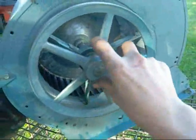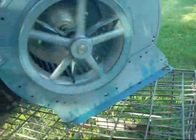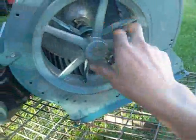I did save this Torrington blower though. The only reason I realised this furnace was scrapped was because these bearings had gone all stiff and gummy — the motor couldn't turn the blower. So I've lubricated that and they're perfect now. It works really well.